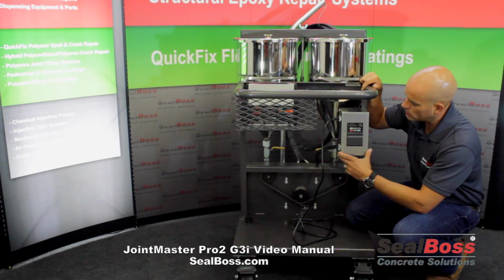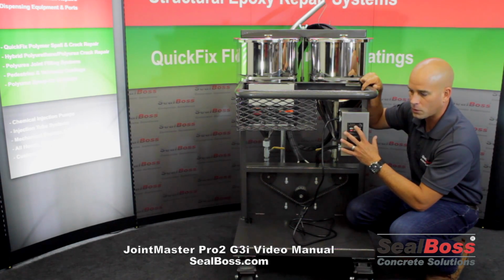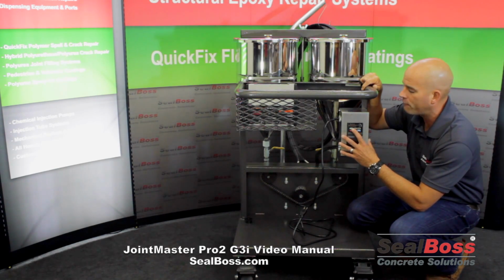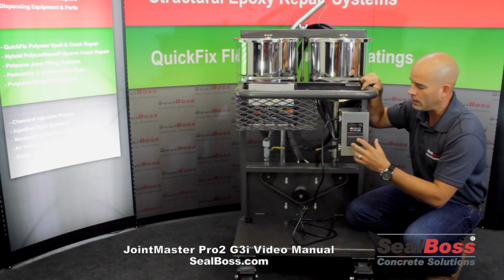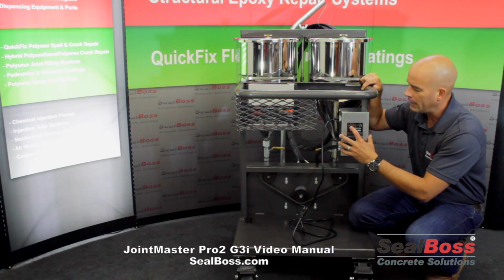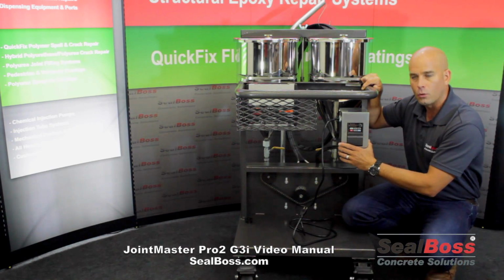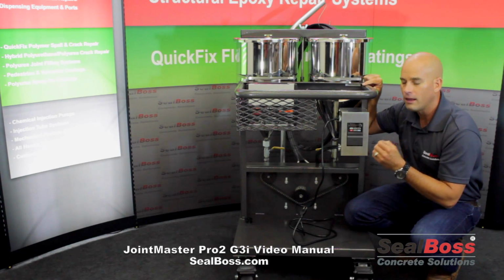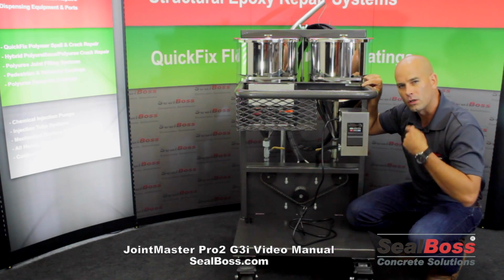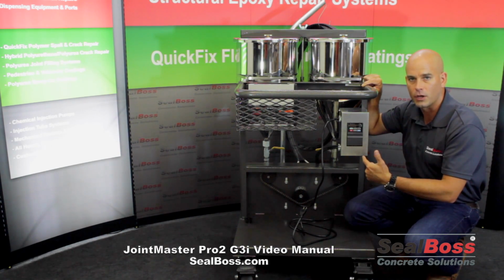Now, a couple things you might see as a built-in mechanism for safety, as well as to inform the operator of any malfunction. There are two different codes that you hopefully don't see but can see: the overload code as well as the under voltage code. With the overload code, it means the viscosities of your A and B might be a little too high, and is causing that motor to work too hard to drive those rotary gear pumps to dispense that material.